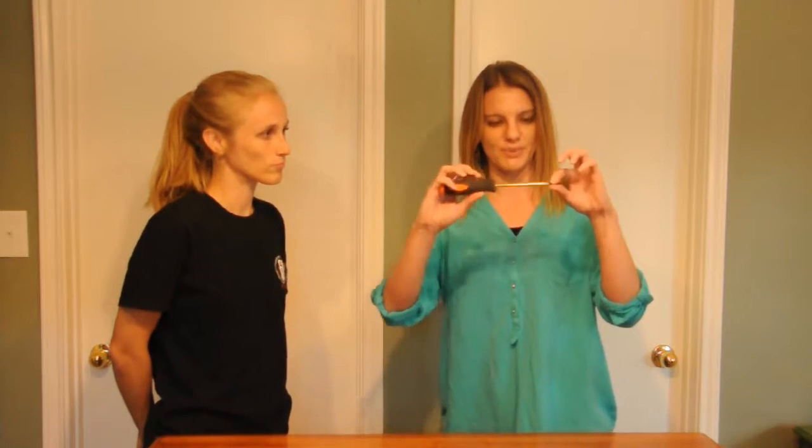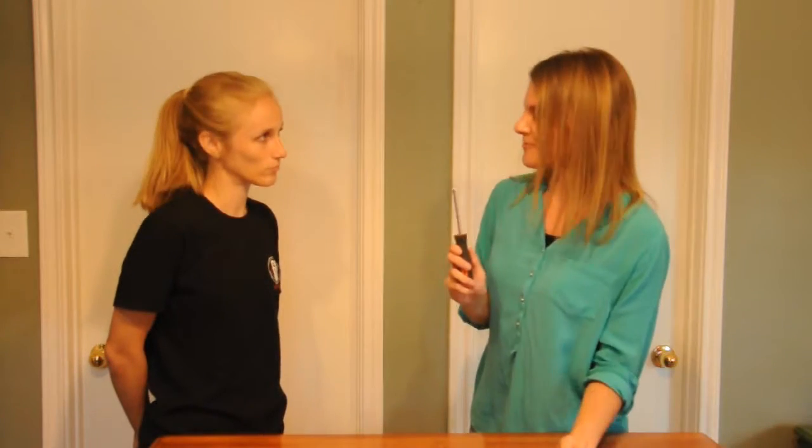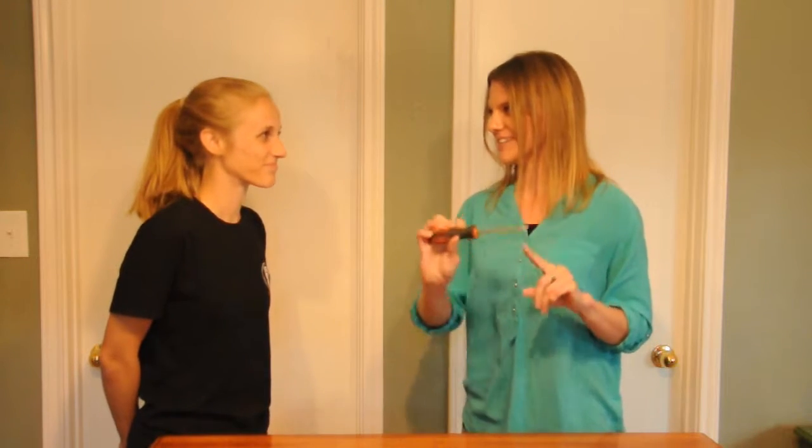Here we've got an example of that. A key thing to know about Phillips screwdrivers is they come in different sizes — same with regular screwdrivers. A lot of people don't realize Phillips come in different sizes. The most common are size 1, 2, and 3, with size 2 being the most prevalent. If you have a size 1 or size 3 screw, do not use the wrong size screwdriver — always be aware of what size you need.